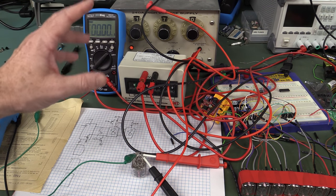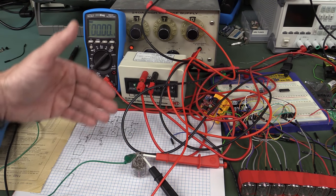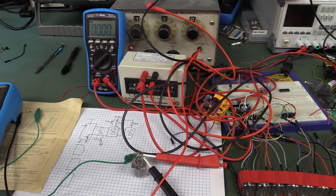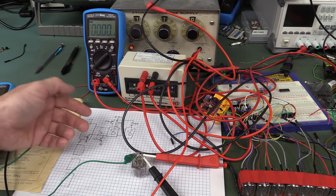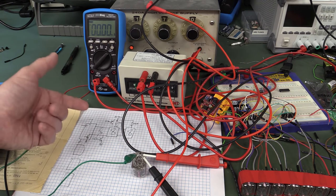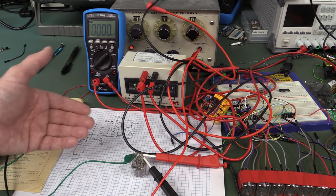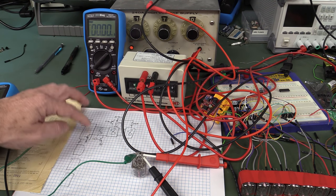But rather than just shoot that again, I'll just display that video here for you about the open circuit voltage drop of the Nixie tubes, because some people have asked, there will be a voltage drop on the Nixie tubes on the pins that you aren't actually switching on with your transistors. So all the off pins will have so much of a voltage drop via the Nixie tube itself that you can get away with low voltage transistors.